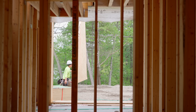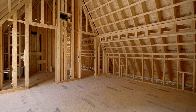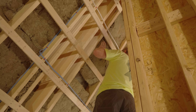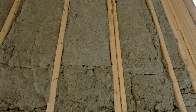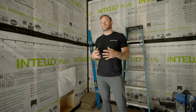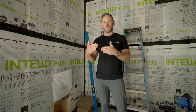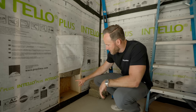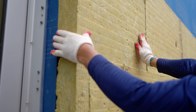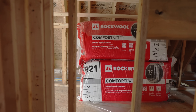Let's start by talking about the wall type. Typical for us, especially in the northeast, we frame everything with wood construction — a 2x material, 16 inches on center. In this case we have a 2x10 wall. Why not a 2x4, 2x6, or 2x8? Mainly for the thermal performance of the wall. We want extra insulation to reduce the heating and cooling requirements for the building. Also from an architectural standpoint — some of these walls are ultra thick to allow exterior pocket doors to slide into. On the outside of the sheathing we have three and a half inches of insulation outboard.